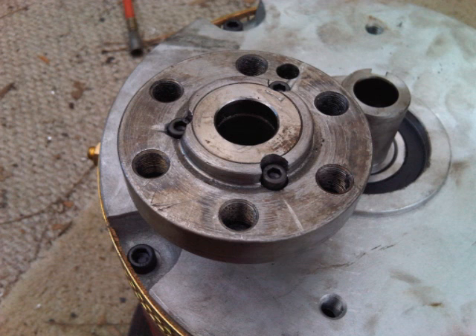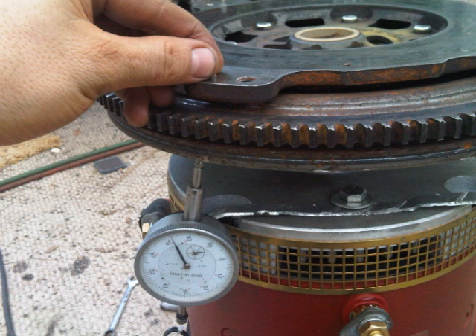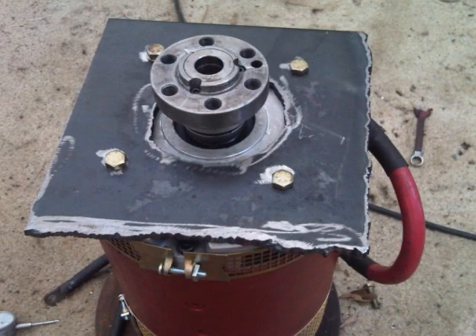This process is trial and error. You start putting it onto the front shaft, making sure to use the key, then spin and try again, keep tightening the screw to make it level. After the first center shaft is level, we had to start testing with the flywheel — because it's bigger, the margin for error is bigger. We were confident the flywheel was perfectly level before we started working on the motor side plate.